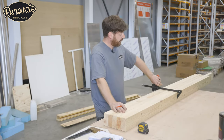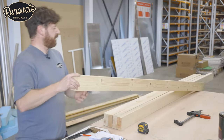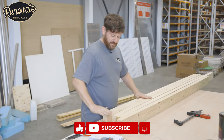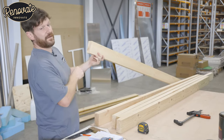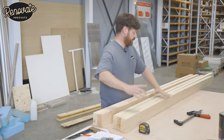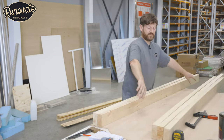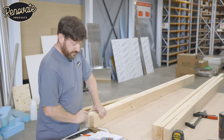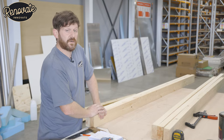As you'll see when I release this clamp, some have got mad bows and cups in them. You can see that this one will be no good to use as a rail — we're not making a circular gate! So we're going to choose the best timbers we've got. These two are the straightest — I've looked down and they're nice and straight and true both ways. The best way to do it is look down the timber as I've just shown you. We can try and straighten the others by clamping them and leaving them overnight, or put a relief cut in just to break the tension around knots. First thing we're going to do: take these over the chop saw and cut our stiles, put a little detail on the top, get them squared off, then mark them up ready for our mortises. Then we'll cut the rails and get them ready for the tenons.